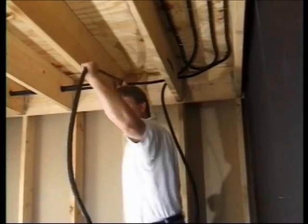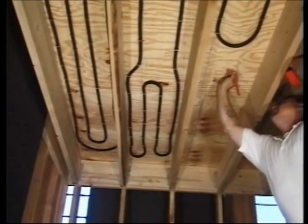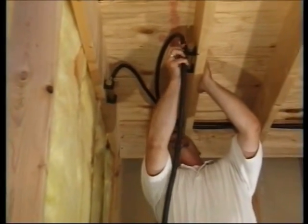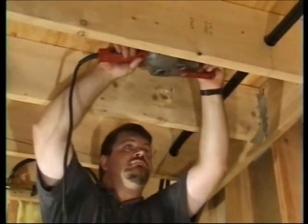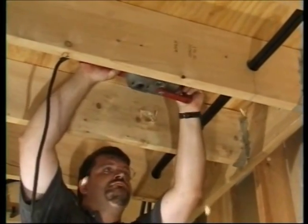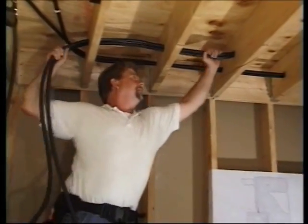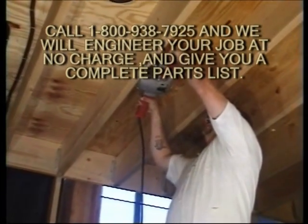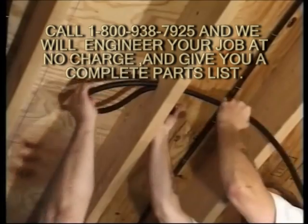When the first bay is complete, pull more Onyx from the unwinder to create another loop. Complete each joist bay, working your way across the room back to the manifold. When the other end of the Onyx falls off the unwinder, secure it to the other manifold. To reach a partially filled joist space, measure eight inches from the first line of holes and drill another set. Mount one end of the Onyx to the manifold as before and pull through to reach an empty bay next to the partially filled bay. Drill a hole through the joist about eight inches from the last loop, then pull through a short loop to fill the area and complete the zone.